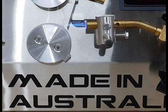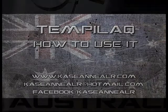Turn your machine on, and set the speed at approximately 70 RPM for large cases and 85 RPM for smaller cases. Now turn your machine off, and turn the flame on. Adjust the flame so it is sitting just behind the case guide. You can do this by either moving the burner in or out, or by using the flame volume control on the torch head. For repeatability, you should take note how you set up the flame so you can repeat it each time.